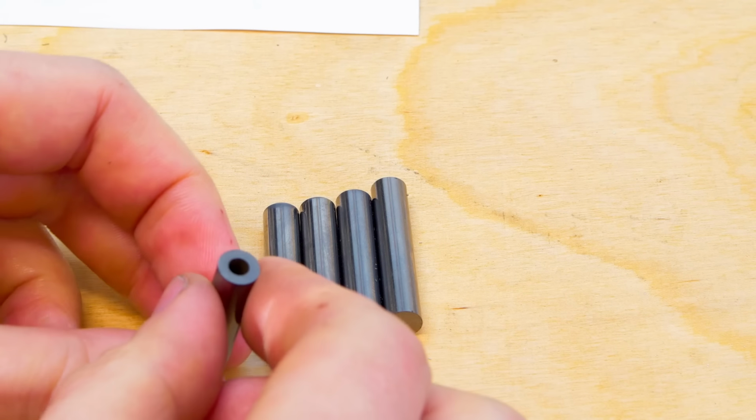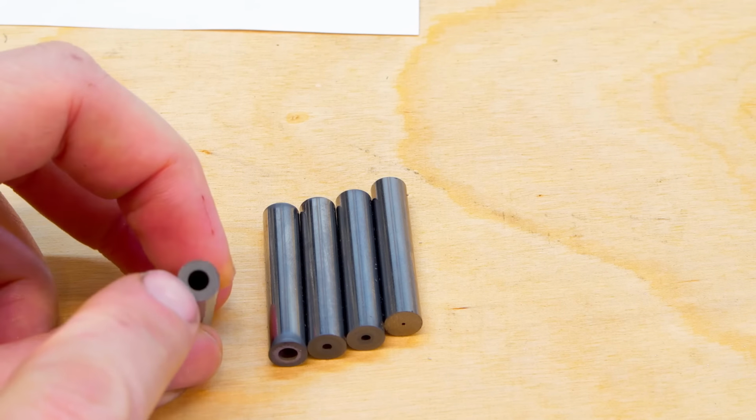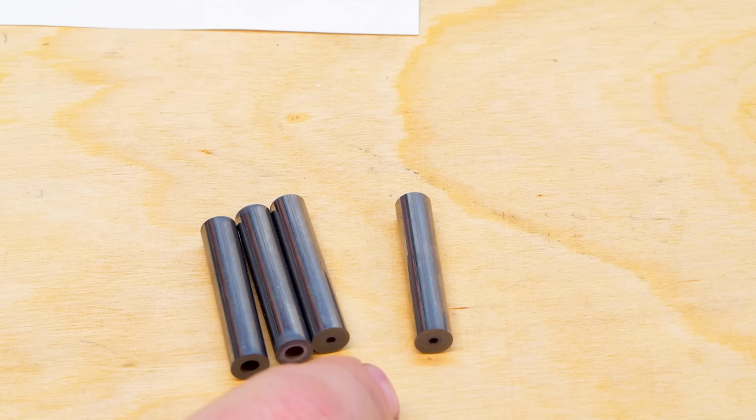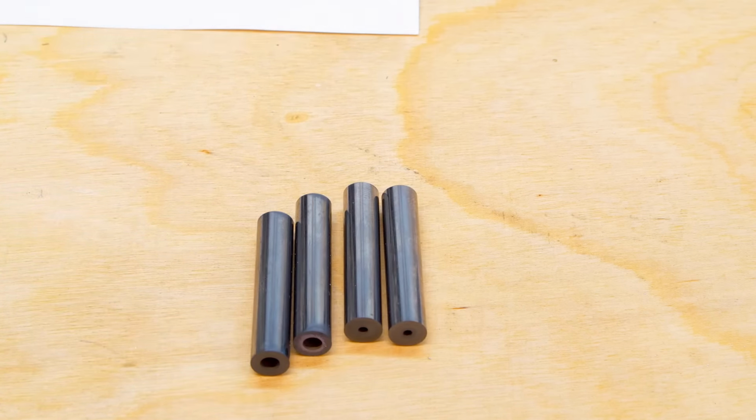The parts are back from wire EDM. My friend cut them very close to nominal size, 4mm and 2mm ID. And he didn't need the spare one, so this goes back in the drawer. I have a 4mm carbide shank here, and this is a close fit in here. So we have some material to work with. I'm going to ID grind it to final dimension.